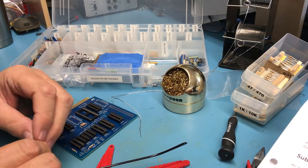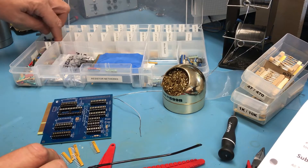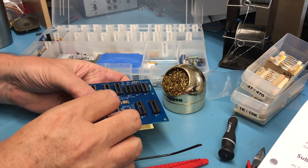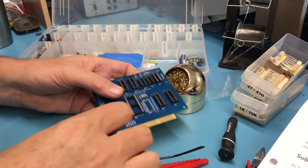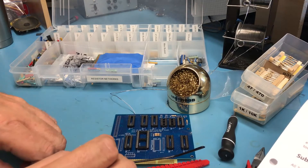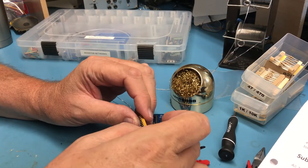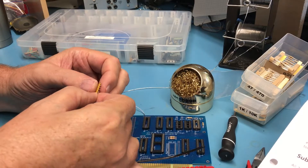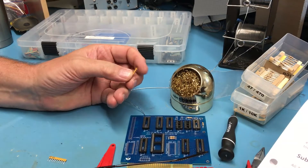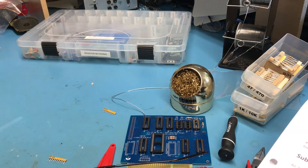Be sure to get bussed — bussed means there's one common power pin and then resistors off to that one power pin. If they're non-bussed, it's just a bunch of individual resistors in there, and non-bussed will not work. I believe that one right there is going to work for me, and I'll need two of these. This is a mix of pulls — a lot of these have solder on the pins where I pulled them off other boards. Because these are pulls, I will go ahead and test each resistor position, just because they do get damaged when you unsolder and pull them out.